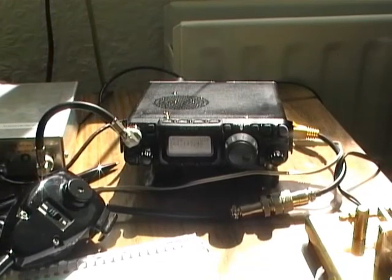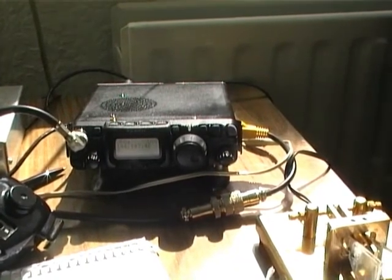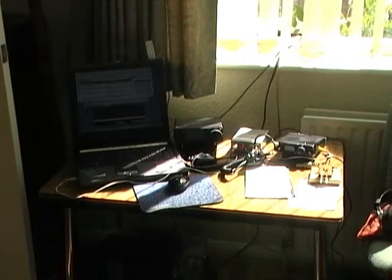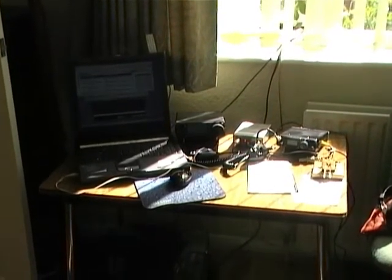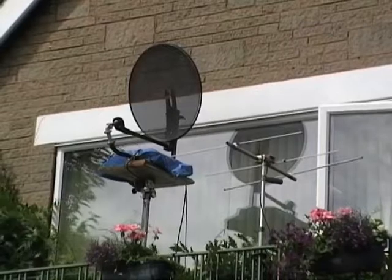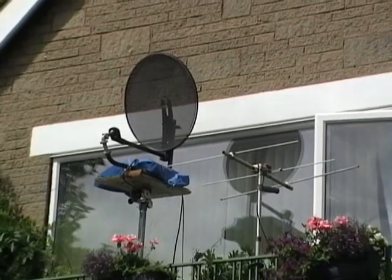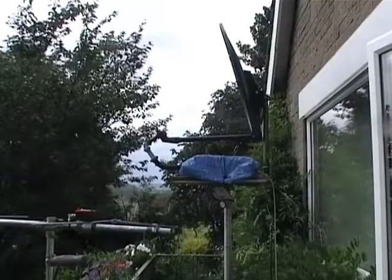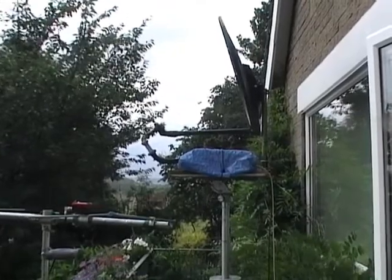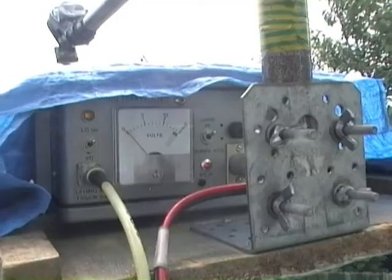G4WLC is coming through on a direct path — he's near Cheltenham. There's no rain scatter on him. This is my portable station, used in the living room instead. Very simple: on the right is an FT817, which is used as the IF, to feed a transverter standing on the platform, which in turn is mounted on a small tripod. This transverter feeds an old Sky or Amstrad offset dish, 60 centimetres diameter. It's waveguide fed into a feed horn that I designed out of plumbing parts.